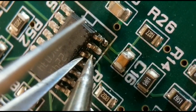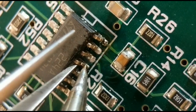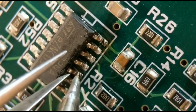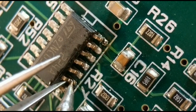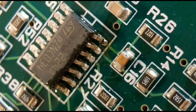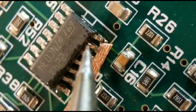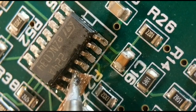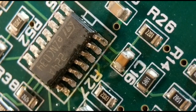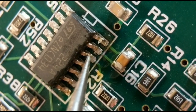This way you can reuse the chips - all you need to do afterwards is just straighten the legs. Get your tweezers under, don't go too high otherwise the chip becomes unusable. This is a good option if you want to reuse the chip, and it's pretty safe. Then get a bit of solder wick and run it along to wick off the solder, making sure all the legs are free. You should see a little bit of movement in all of them.